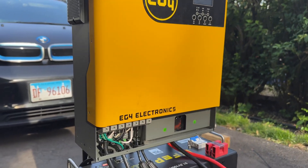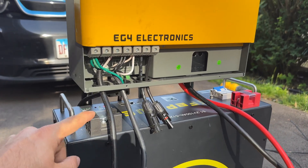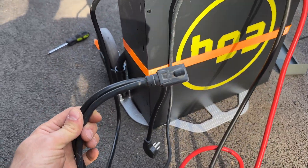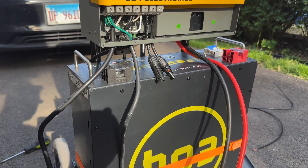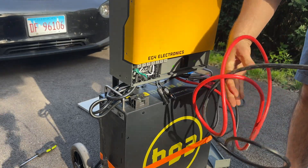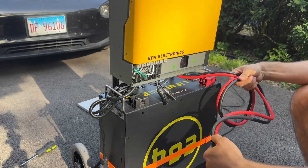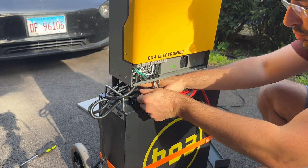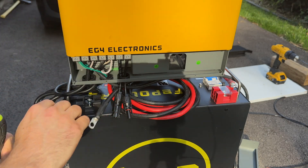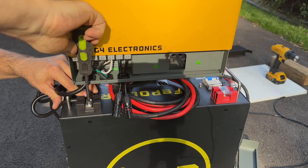Here's how everything is looking so far — all our wiring is done except we just have to connect the battery, which will be the last step. There's plenty of wire here and ideally we'd cut it to size, but I'll just connect it as is and hide the wire up there. Make sure the inverter as well as the battery breaker are both off before you connect the battery to the inverter. This has to be fairly tight — use whatever you need to make it nice and tight. We'll put the cover back on and do the positive side now.